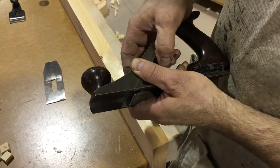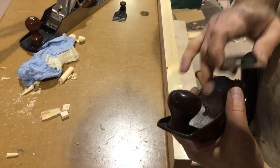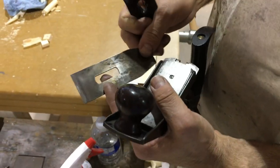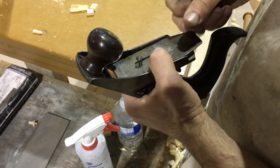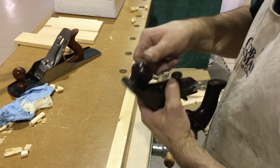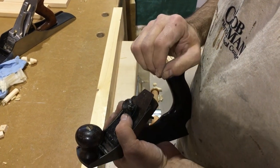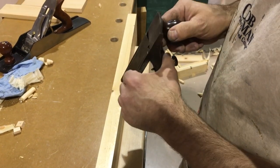I'm going to set the toe piece in line with the rest of it, mostly so I can look down there and sight the blade in. I've never used this before, so you're seeing it for the first time. Put the lever cap on. That blade doesn't fit terribly precisely in there, so there's lots of lateral adjustment. That's good because if you get the blade a little out of square from frequent sharpenings, you're not going to have to constantly be squaring it up perfectly — you've got a little bit of movement. I'll put that fairly close, put the lever cap on, and sight down that sole. I've got it sticking up on the right side, so I'll move it over a little. If I had my little brass hammer here, I would just sit there and with this relatively tight, you could just tap it and it'll move a little bit — it can actually be pretty precise that way. I don't want to use a steel hammer because it ends up mushrooming the end of the blade.